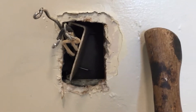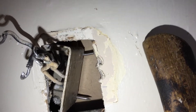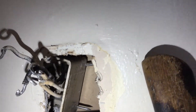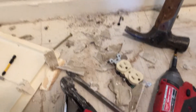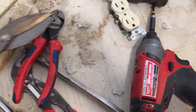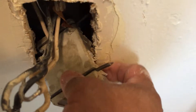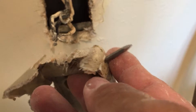I'll get my snips and snip the box up in pieces to keep removing it and get a new one in. Most of the box is broken up — a little snipping, and tin snips did the job. Thank goodness the box was soft enough to fall apart in pieces; it's an older box, looks like fiberglass, probably original — about 40 years old. Got it out. I've got all the new wiring here and the breaker's off. I'm hoping to test which is line and which is load once I get the new box in.